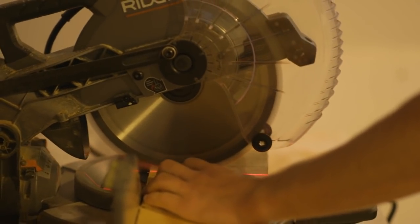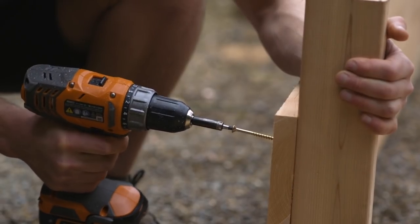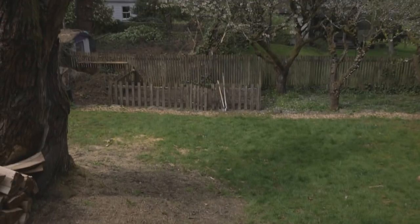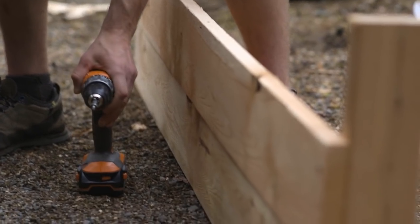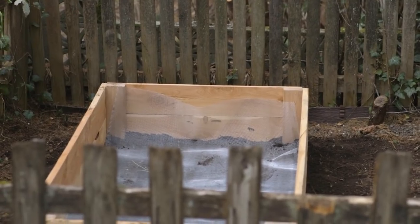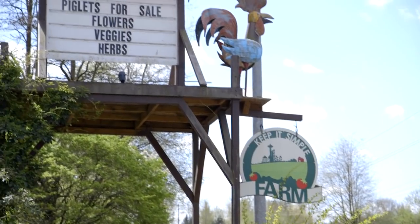Seattle has this local tool library. You don't need a lot of tools. What Chris is using here is a table saw — you can just use a handsaw. Basically, we're making a rectangular box; couldn't be simpler. There are going to be small two-by-fours in the middle as braces where the ends will meet. Just put two screws on each side, and we're going to have a three-foot cap on the north and south sides. On the horizontal east-west sides are going to be two-by-four by six-and-a-half-foot boards. You don't need much more reinforcement than that — the dirt's going to hold itself compacted in there.